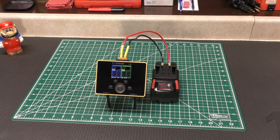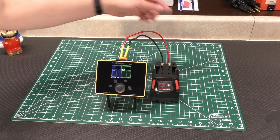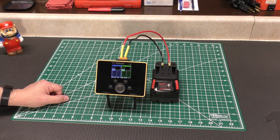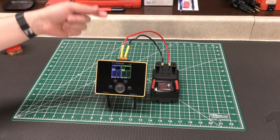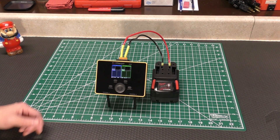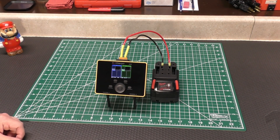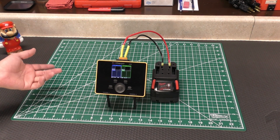In the last part, I'm going to show you some accessories. I got this charging adapter from eBay — it comes without any connector, so I soldered on an XT-90 right there. Now I can run it, especially in demo mode, off a battery. If you have a large power tool battery, they can be pretty good. I have another one for my Milwaukee leaf blower — I think it's 9,000 milliamp-hour — so I can actually charge batteries off that. These are all smart batteries, so when they run out of power they actually kill themselves before they become underpowered and begin to damage themselves. So that's why I bought that — it's really just for the road.